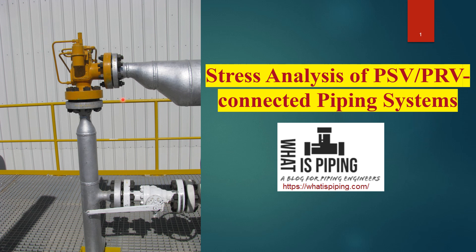In this image you can see a typical PSV connection. This side is the PSV inlet and this side is the PSV outlet. Fluid comes through the PSV inlet, and when there is excess pressure, the PSV mechanism pops up this valve and the fluid flows through the PSV outlet, releasing the pressure. In general, the inlet side of the PSV remains at high pressure — for example, if this line is of 300 rating, it will have 300 rating flanges.